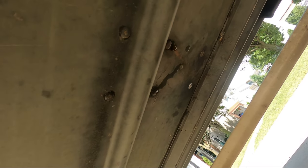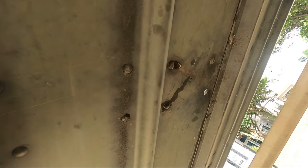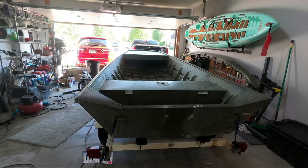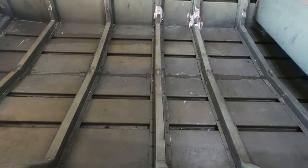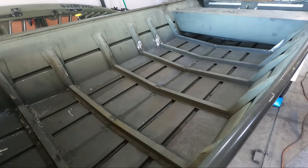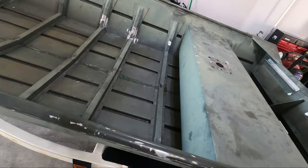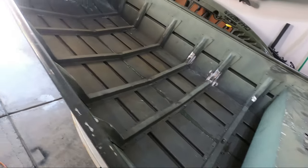We're under the trailer now and it's pretty easy to see which ones will need to be fixed. That's the one I put in, and these are the ones I fixed already — there's no leaks from those. So now we can see which ones are leaking all the way down. Unfortunately, almost every rivet is leaking and that's not really an exaggeration. Pretty much all the rivets along the center of the boat were leaking. The ones towards the sides weren't too bad, but the middle ones are pretty bad. My guess is that they overloaded the boat, probably with a deck that was too heavy, and just wore out the rivets. I didn't notice any damage under the boat from hitting logs or anything like that, so that's good. I think that once we get this all tightened up, it's going to be waterproof.